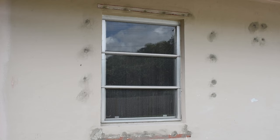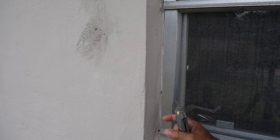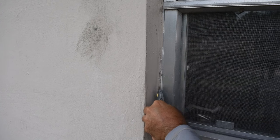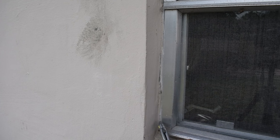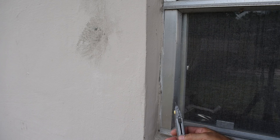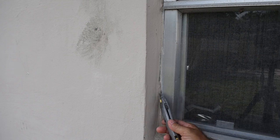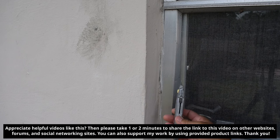The first thing you're going to need to do is take a utility knife, a very sharp one, make a cut right in the corner of the window, all the way around the perimeter, and you're going to do the same on the inside. The outside is much less critical. You want to go right into that corner and cut straight down — you can see how nice it's opening up. Do that all the way around the window and it's going to make it much easier when the window is collapsed inward to remove it from the opening. You definitely want to do a good job on the inside because you do not want the plaster or drywall to be damaged.